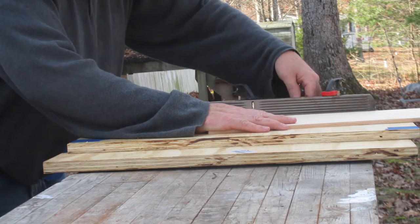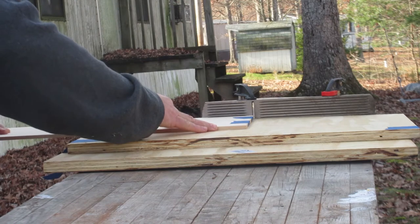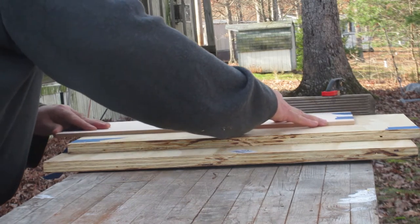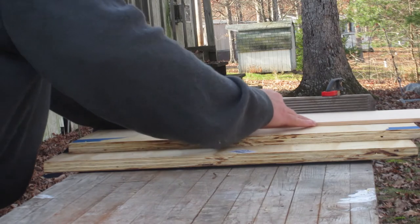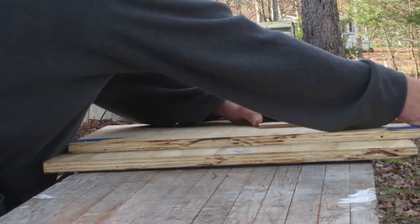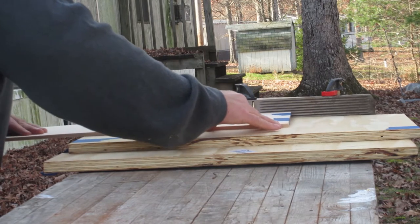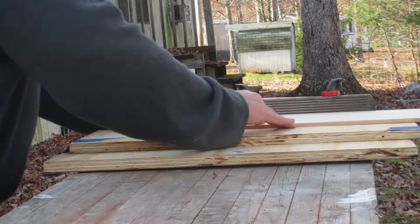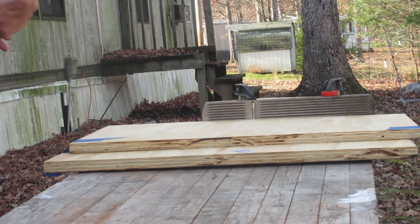The fundamental idea is that you joint it by running a plane along the edge until you get a flat surface that mates together. I've got both pieces of the soundboard taped together so that when I cut that line, I'm cutting both of them at the same time. It's a slow process, but you've got to be careful — one time I ended up taking so much off that the board wasn't wide enough and I had to order another top and start over.